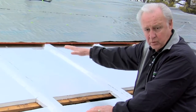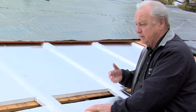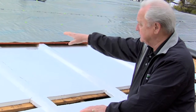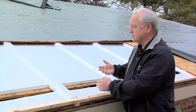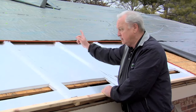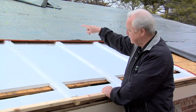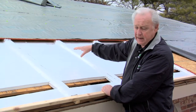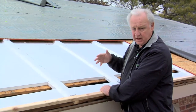We're going to be putting a composition roof on top of that, and here's what's actually going to happen. The sun is going to heat up the composition roof, which in turn is going to heat up the decking. The decking is going to heat up the air adjacent to it, causing that air to rise up toward the vented ridge. Additionally, radiant heat is going to go through the composition roof and the decking and would normally accumulate in the attic, but in this case we reflect it back where it's coming from so it's not going to reach the attic.